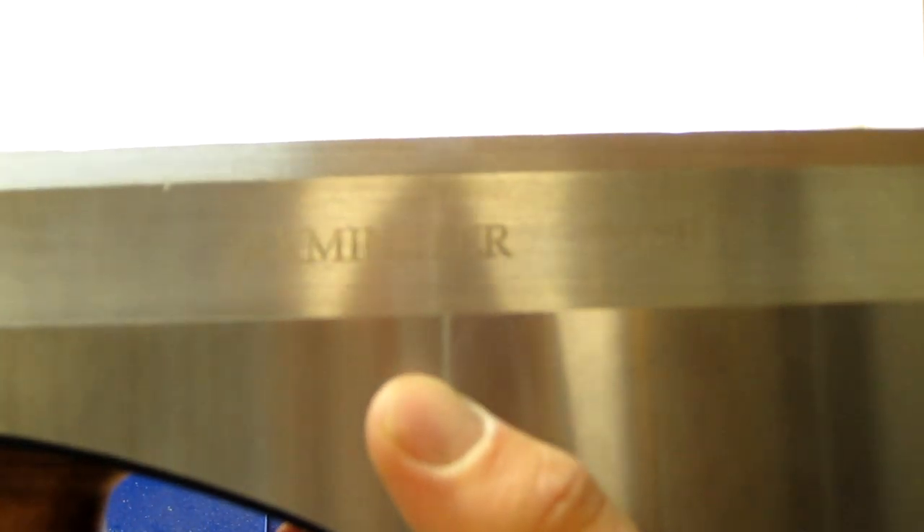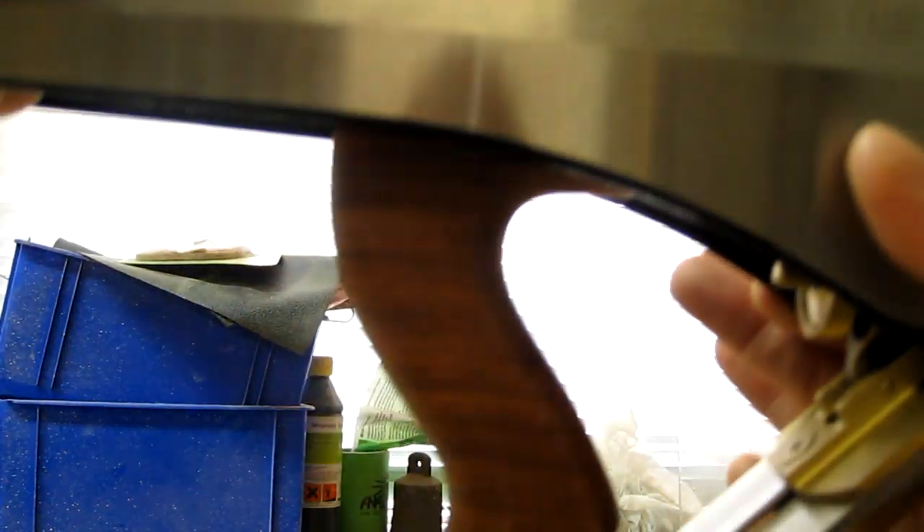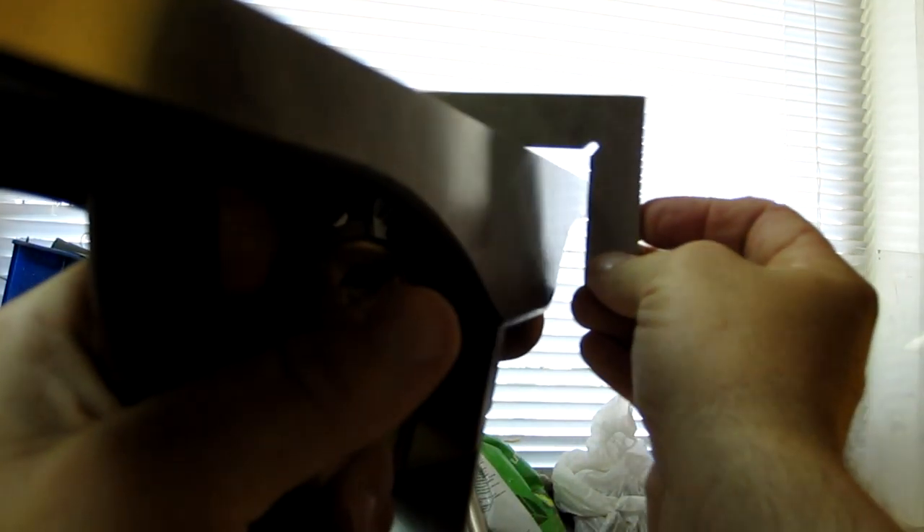Can we see any light showing? Actually, there is no light showing underneath it. The casting seems very well — it's a heavy plane sitting on one straight edge. Let's also try to check the sides. Put on a reference square, and we can see again that there is no light. It's perfectly square.